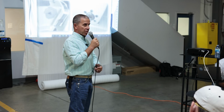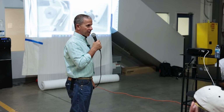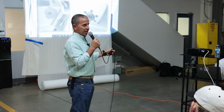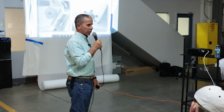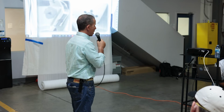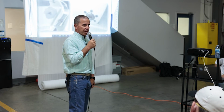As I said, that's important. Those metals technically are not compatible with each other on the galvanic series. But if that wasn't painted, you wouldn't even be thinking about this. It would just be sort of normal corrosion between the two that takes a long time to occur. And this is more a case of the coating being breached by the fastener.